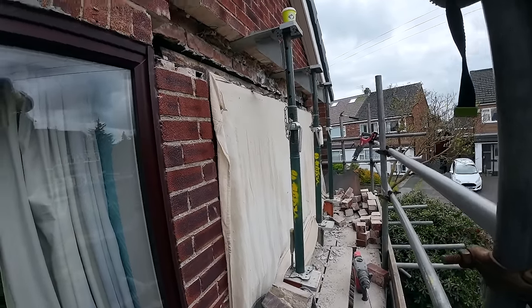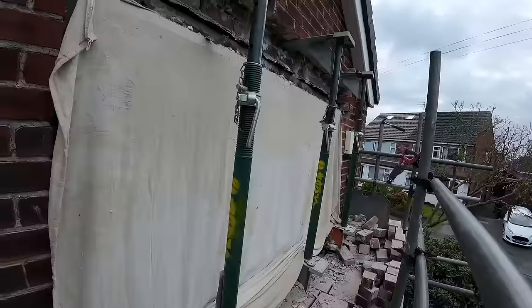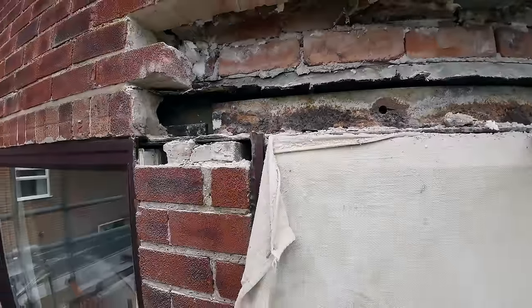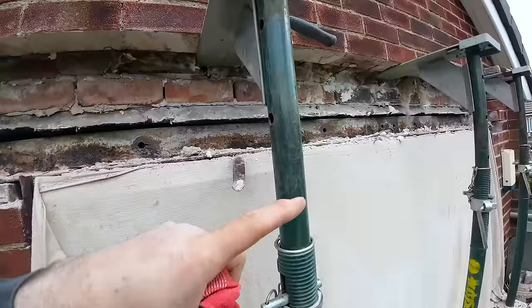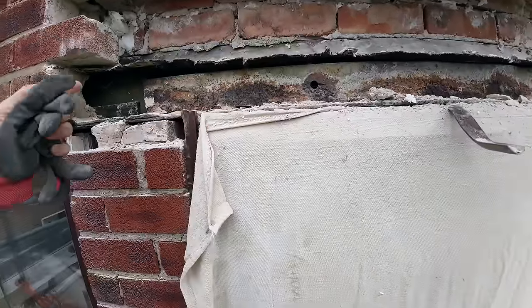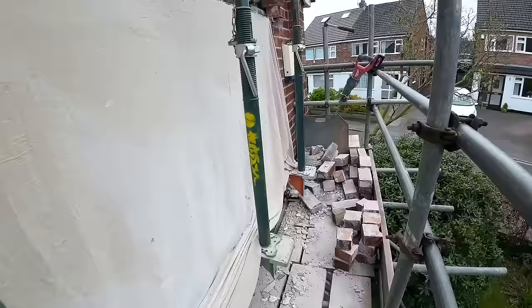It's very stable brickwork, this. So what I need to do now is get this steel out, get these bricks bedded back on both ends, get our lintel on, and get the cavity tray done. So still plenty to do before we start the brickwork. Oh yeah, we need to organise ourselves here as well.